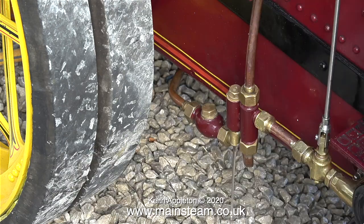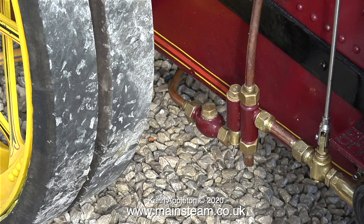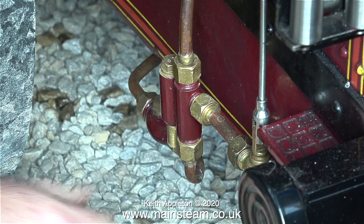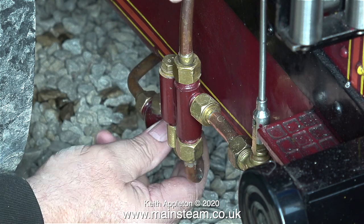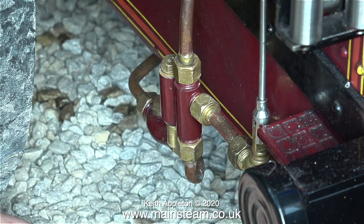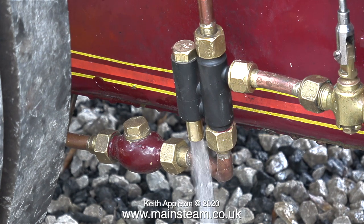This next clip shows the injector fitted to my four and a half inch scale traction engine. This is a vertical type injector, also made by Jubilee Fittings but quite a few years ago. It still works but it's dribbling a little bit, so I'm going to change it for a new Jubilee Fittings injector. Originally the water valve was leaking but I fixed that with some O-rings. The new injector fitted to the existing piping was only slightly better — it still dribbled a bit. I really think the problem is this extra check valve in line, so I'm going to remove that and see if it's an improvement.